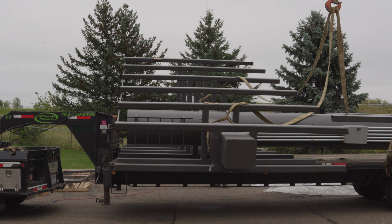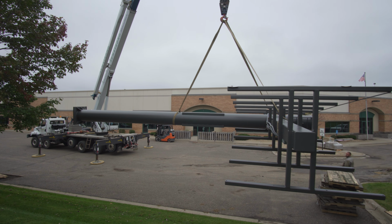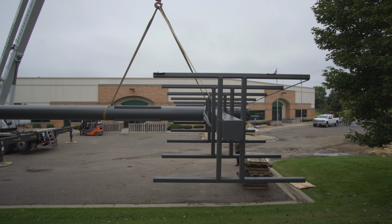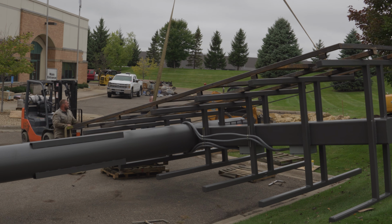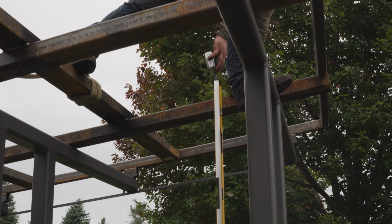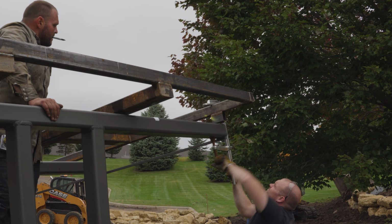And we quickly learned that the further away from the crane you want to go, the bigger crane you need. So these little cranes worked pretty well for helping move the sign closer into position near the big sign. Here you can see now that everything has been fabbed and painted. Now they're fabricating the detachable frame that all of the LED modules will attach to. So that needed to get fabricated, welded, and then bolt holes drilled in it to set the locations for all the bolts that are going to attach that.